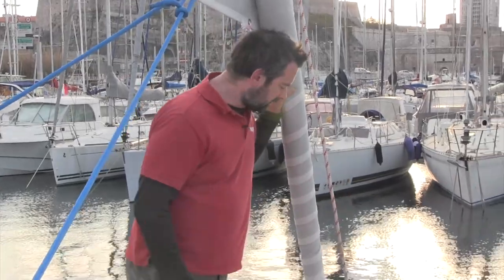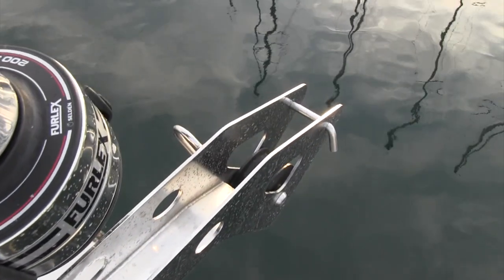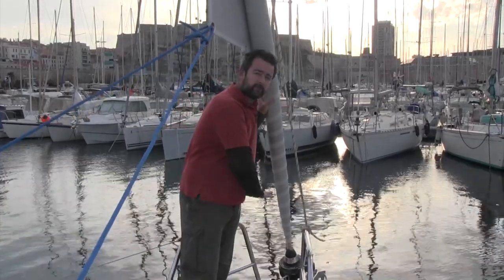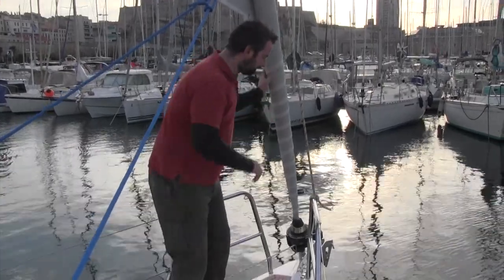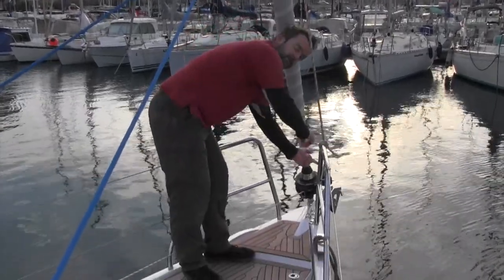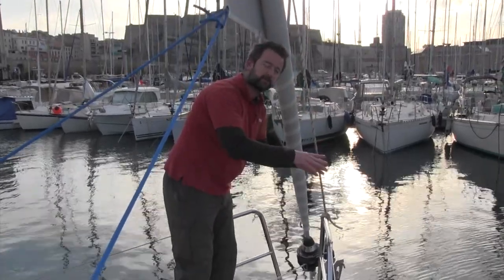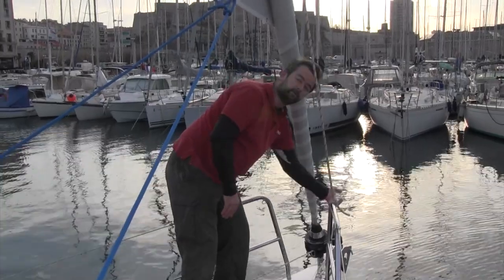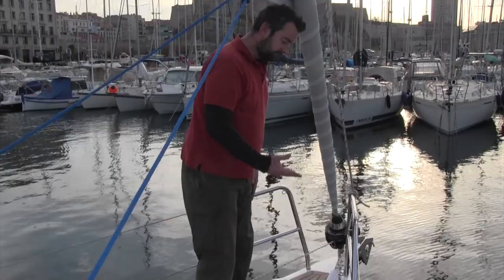We'll start as ever at the bow. We've got a single bow roller here, offset to starboard, and you'll notice just on the tip of it there is a gennaker tack — you can tack the gennaker and away you go. Quite a low furler, which allows more sail area for the jib, but with this being an open pulpit you've got sort of 6 to 8 inches of jib. If you crack the sheets they'll be outside these, and if you come hard on the wind you'll have to come up here and pull them back in again — a minor inconvenience, but needs doing.